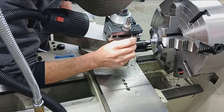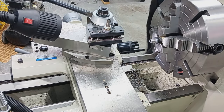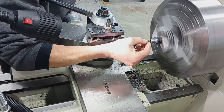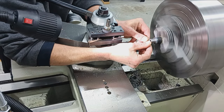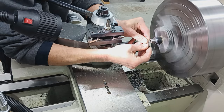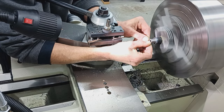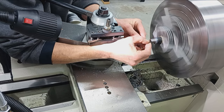And no considerable snagging there. It's a tiny thing right there. So let's hit that with a real light sandpaper, just to kind of break that off. There's a tiny burr I could see. That should be enough. And then we'll just polish this flat crown while we're at it. I'm not going into the bore here. Just polishing the surface. And just touching that chamfer, 60 degree crown.